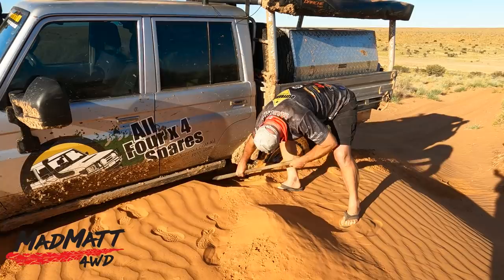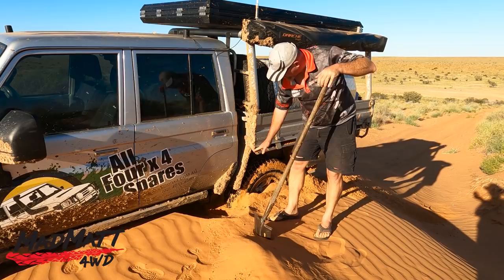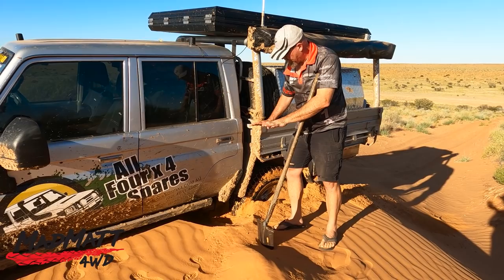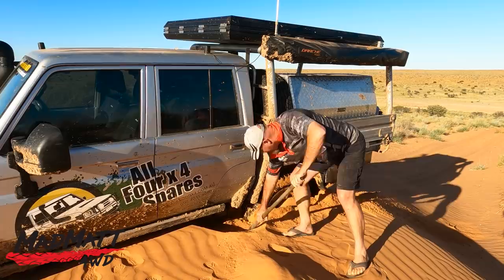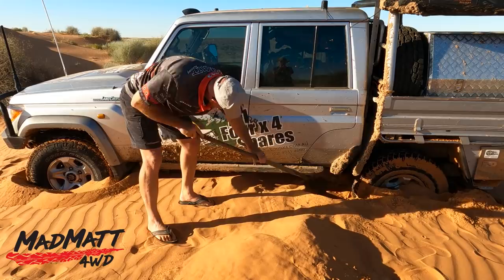What I'm trying to do in these trenches is create the shape so that as soon as the vehicle starts to move forward, the vehicle starts to lift. So within that distance, I want the vehicle to be lifting - and that frees up a lot of the underside automatically. So I'm basically creating a ramp.